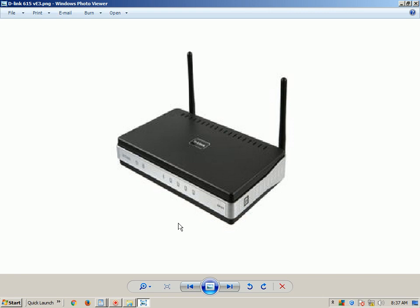But the only problem is, once that firmware is built with LuCI in it, it's integrated so well I couldn't pull it out. No matter what I tried, I just couldn't get LuCI off of that build I downloaded off of OpenWrt. So I just took my custom build, built it without LuCI and without the firewall, and then I added Batman Advanced on there, loaded it up, configured it, and everything worked great.